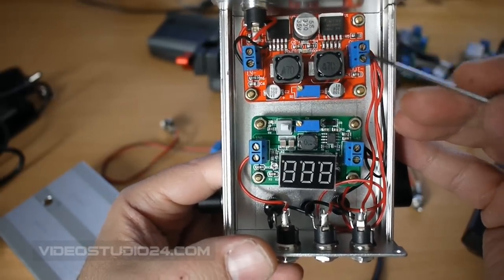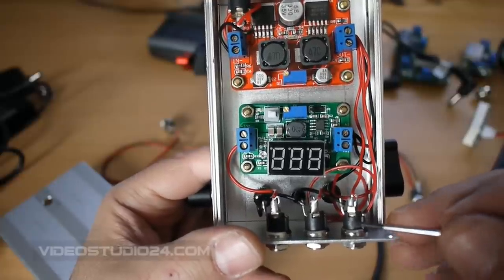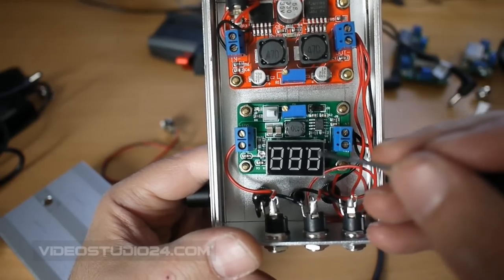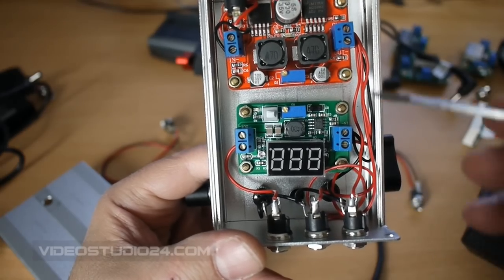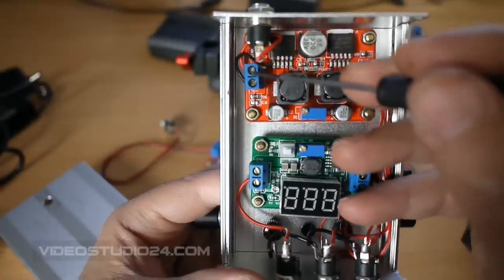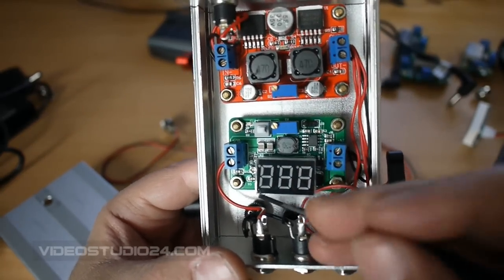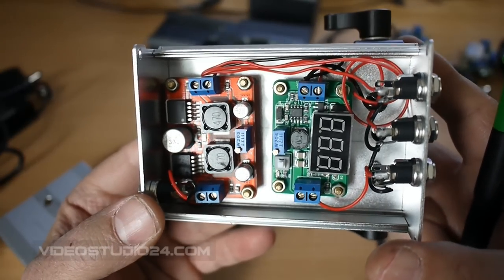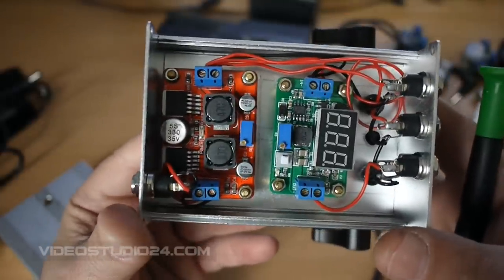Here the input, here is the output — all output, 3 wires, red coming from here into each connector. So this is 12.5 volts for this connector, and this connector is for DSLR going to the second step-down which has a built-in voltmeter. The minus or negative is just one wire going around into minus here and then minus here, so the plus goes plus here. Don't mix them — although some of these modules have polarity protection, it's better to do it right from the beginning.